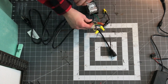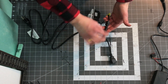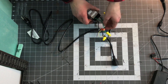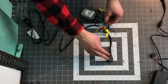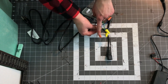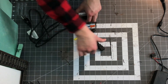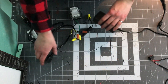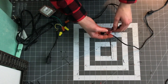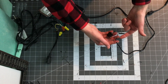The other black wire goes to the hot wire on the transformer cord. The final wire is white, which goes to the neutral on the transformer. I just use wire nuts to connect all this stuff. On the other side of the transformer, we've got just a power and ground. I snipped it in half and reconnected the grounds — I will add a wire nut momentarily.